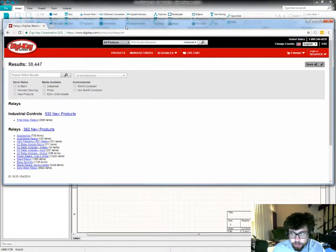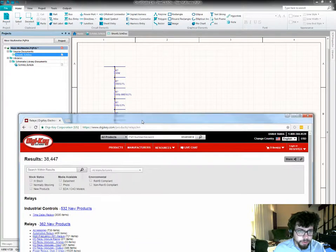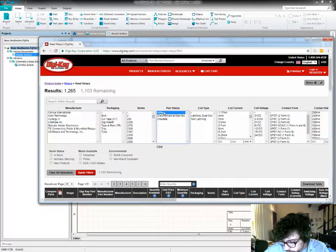relays. So I'm going to use relays to select each of the inputs and not some kind of solid state switch, because at the 100 volt and 1000 volt ranges there will be a voltage difference of about 1000 volts across the two terminals of whatever switching device is on the highest tap. And if that's, well, let's just say a silicon device would have a hard time standing up to that. So I'm going to look for reed relays because that seems to be the commonly recommended thing. I like parts that are active and in stock.